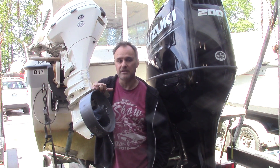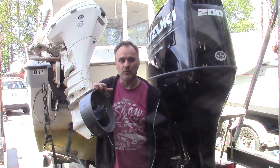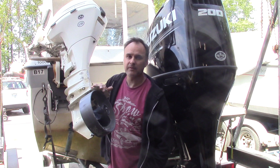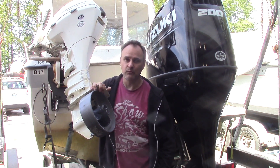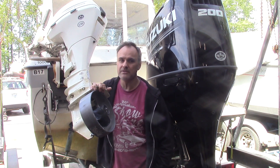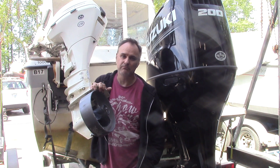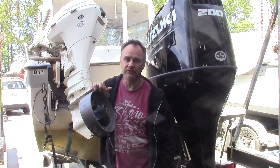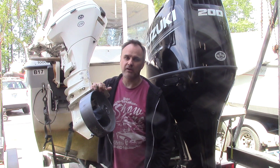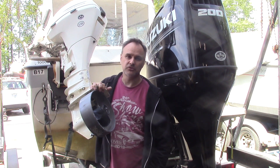It's also quite recommended that you take your boat out of the water for the off-season to allow the hull to dry out. Behind me is a boat that has osmosis and we are going to repair it. The owner has been keeping the boat in the water year-round for the past 10 years and it has never been bottom painted. He has been pressure washing the bottom every three or four months. The blisters are now forming in mass quantities. We will repair the blisters, apply the epoxy and anti-foulant, and we'll show you the whole steps.